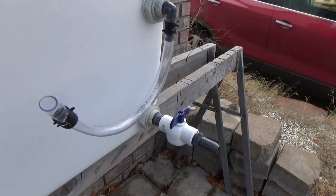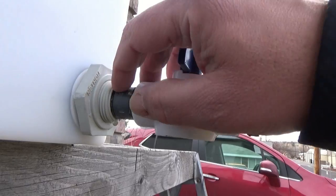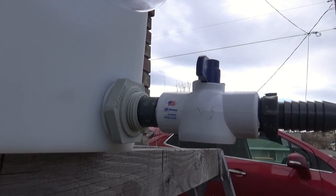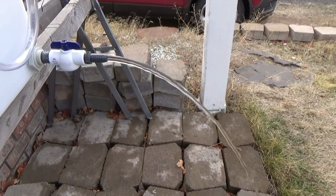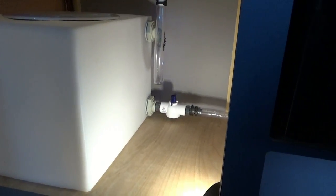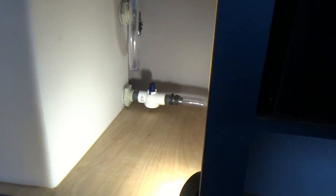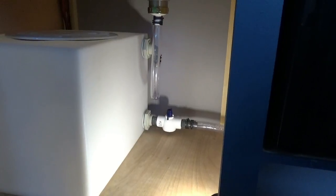It's been about an hour and I notice one little drip here. I think it's this fitting - I'm going to drain the tank, take this out, put some more Teflon tape in there, and fasten that down, and I think we'll be secure. We're back and everything's reinstalled. I'll fill the sink up and make sure we have no leaks. I did take this fitting off and put more Teflon tape around here, and I think that's going to secure our fitting. Let's give it one more test and be done with it.